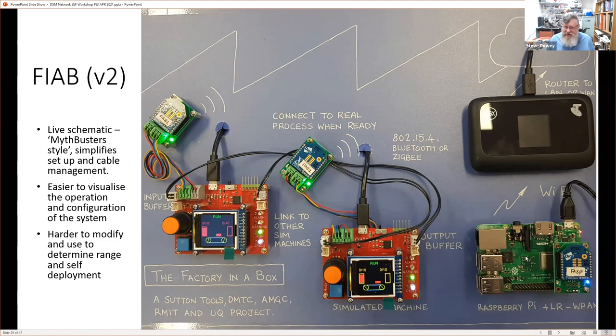So this Raspberry Pi here, hopefully a little ring will have appeared, is an edge computer. And so this is our edge device. This sits on the edge of our network. It sits on the edge of two networks. It sits actually between two networks. So these devices, Fab 0, Fab 1, and Fab 2, form their own wireless network that's not an 802.11. It's not a Wi-Fi network. It's a different type of network. It won't interfere with the Wi-Fi network.